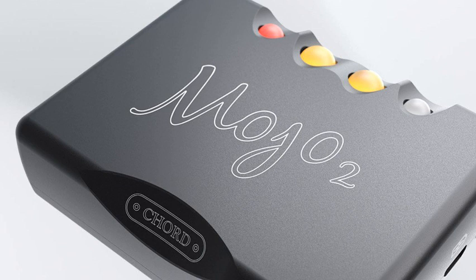Right. There's a 20 hertz peak filter, so you can increase by up to 9 dB or cut by 9 dB at 20 hertz. You've got a 20 kilohertz peak filter, which again, plus 9 dB or minus 9 dB. Then you've got a broad shelf, which means that from 125 hertz right down to DC, you can boost it by 9 dB or you can cut it by 9 dB. And then there's another one for the treble, a treble shelf, 3 kilohertz right up to 20 kilohertz. You can increase it or decrease it. So you've got control over treble, you've got control over the mid-range and the bass, and you've got control of the extreme treble and extreme bass.